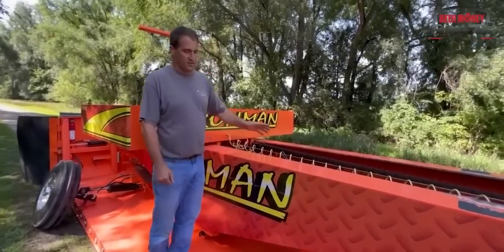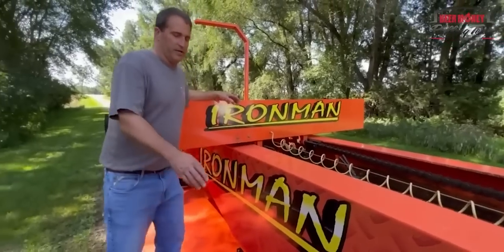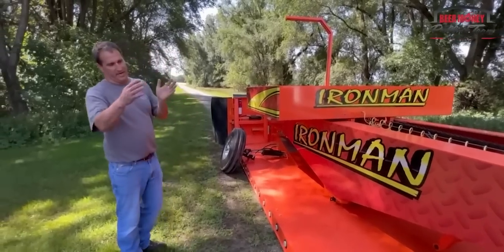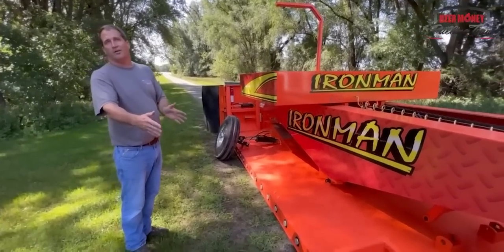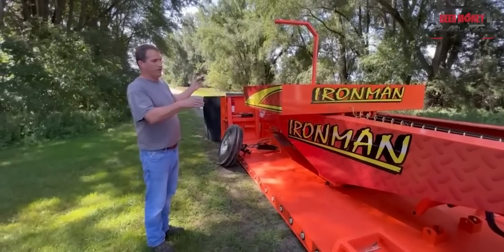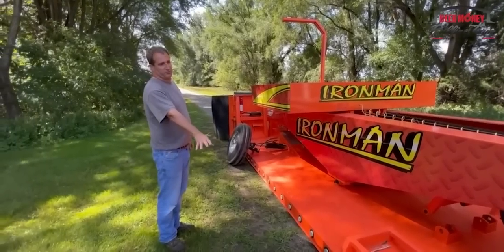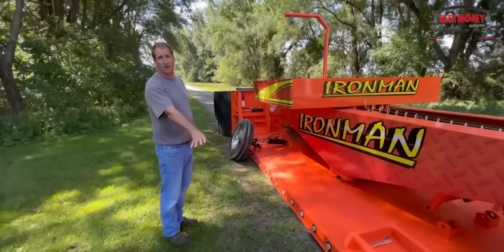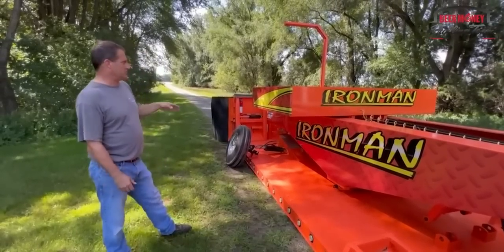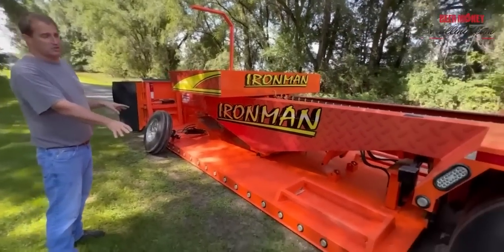Then the box continues down the rails, and basically we need to back up, because when that pan goes on the ground, we are going to start losing drawbar. Rather than all the weight being on our hook, we have now let this free, and now we've got weight back here also. So that is what you call your transition area, because you're taking weight off of your tongue and putting it on the back of the pan to start slowing your vehicle down.